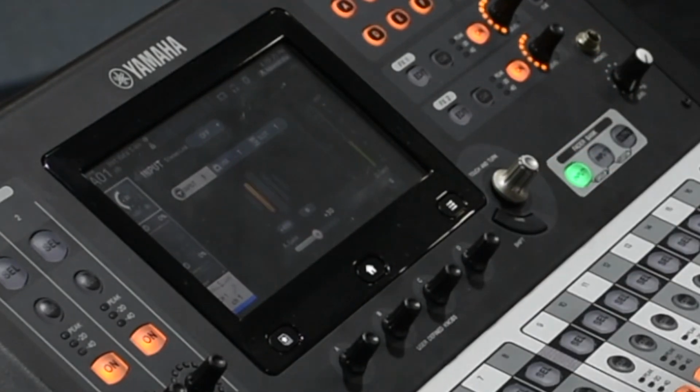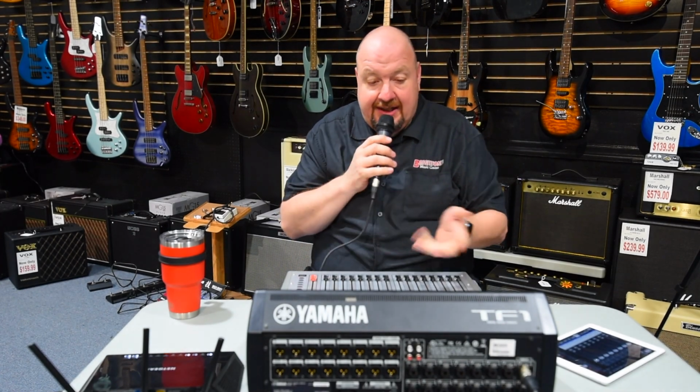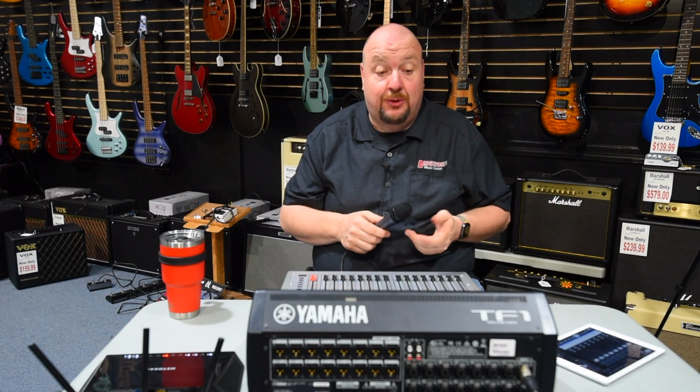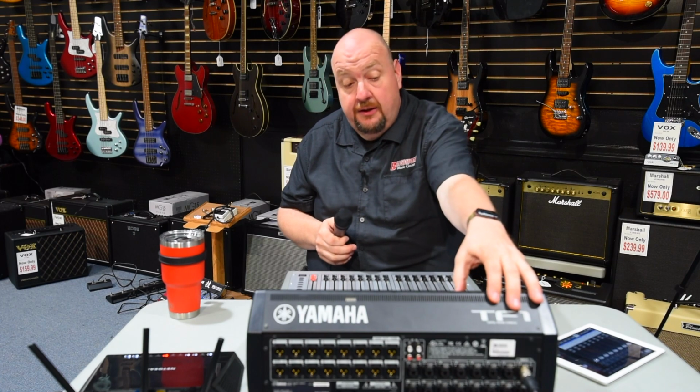So that's just like a guitar tuner, right? So when you're on the green, you're in tune. It's the same principle here. When the light's hitting the green, that is your unity gain coming in from the mixer. So that actually makes it very easy for a board operator that's never done anything before. Very easy to set. They've also moved that into the EQs.